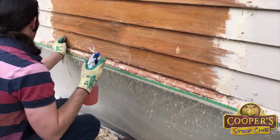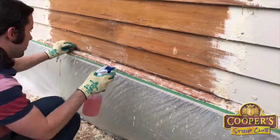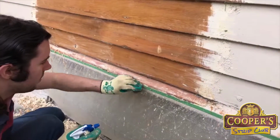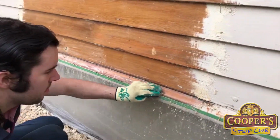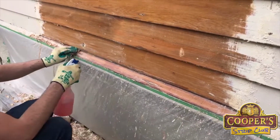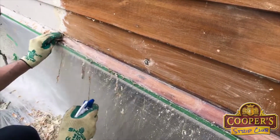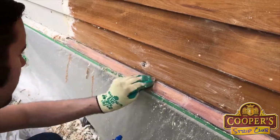Question we often get is, can you clean the pads? You can to some extent. What I do is I get a jar, like an old gherkin jar or something, and put some solvent in the jar, and while the pad is still wet and mushy, just put them in so they can soak overnight. Then you get yourself a sort of high pressure on the end of a hose and give them a squirt out. Each time you go around using them that way, the pad will have less and less grit in it.